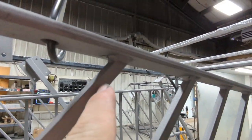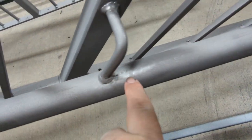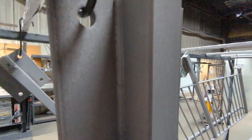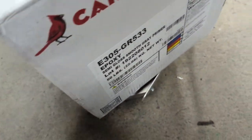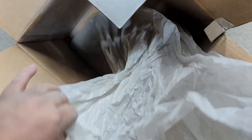Here I'm showing you that you want to get up into these weird corners. These had a bit of an angle to them because they were railings going up and down staircases, so you want to make sure you get deep into these corners every time you start spraying, and get all the welds really well. Anywhere that rust is going to form it's going to be right in those corners, and that's also where powder is typically thin. This customer specifies a Cardinal e305 epoxy primer, so we're going to be throwing this in the Optiflex Pro to start laying down some powder.